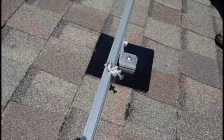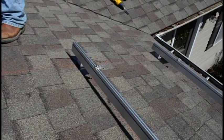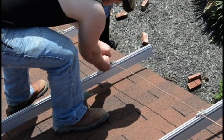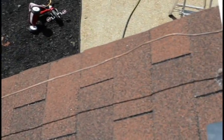It's important to tighten the lug until the dimples are securely embedded into the rail. Each row of modules gets one Weeb lug. Ensure the lugs are laid out in a straight line from the roof peak to the gutter. When all the lugs are connected and secure, you can run the copper ground wire for the entire array and secure it with the Weeb lug's secondary bolt.